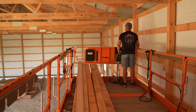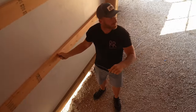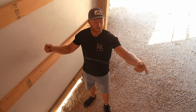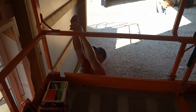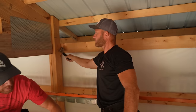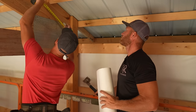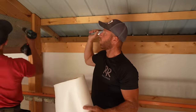Let me go ahead and put that back up. So this is what we call our Tyvek wire — I don't know if that's trademarked, but it's going to support our air deflectors. It's going to run the length of the building, and you'll see exactly how we utilize it. What we've got to do is drill and place bolts top and bottom of our truss — that's for structure — and then drill and place a wire all the way through, which is what Greg's doing.